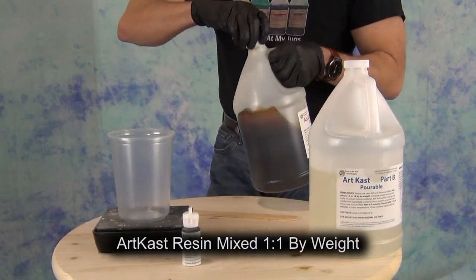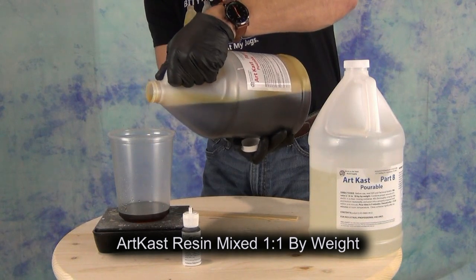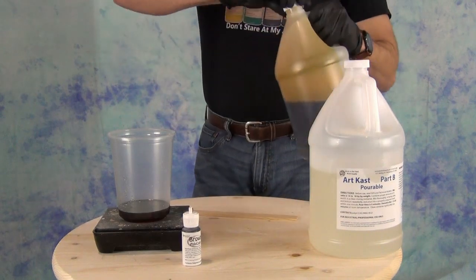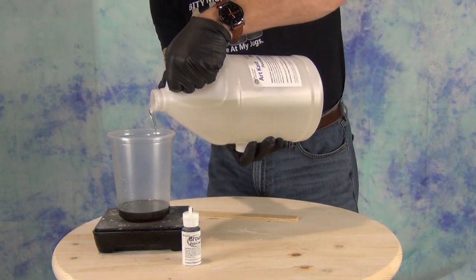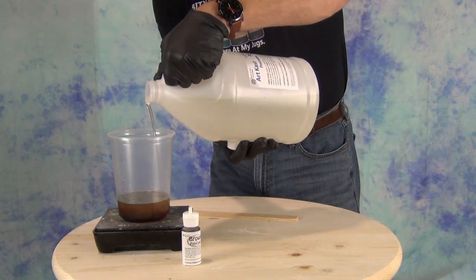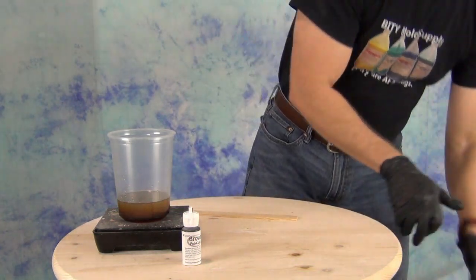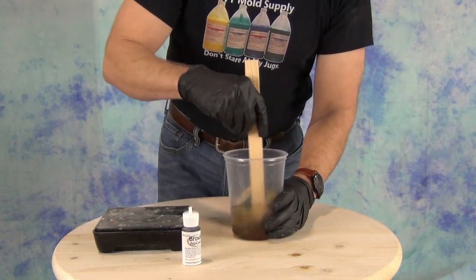This next part is more of an art form than a hard science. When you're rotationally casting, there is a little bit of guesswork involved in making the first part, and one of the main things I wanted to explain is how to figure out those amounts and adjust as you go into production. For this, we wanted to only mix up a minimal amount of resin — here I'm mixing up 100 grams of part A and 100 grams of part B. ArtCast resin is mixed one to one by weight, so we don't want to mix too much; all we need is that thin membrane of resin coating the inside surface of the mold.